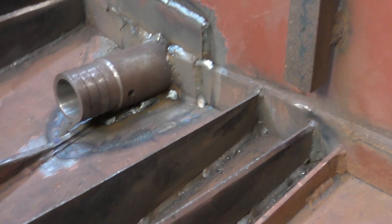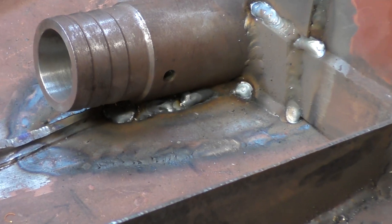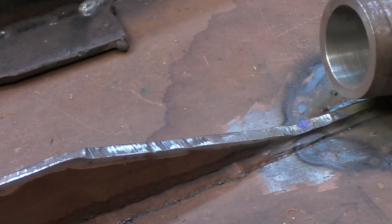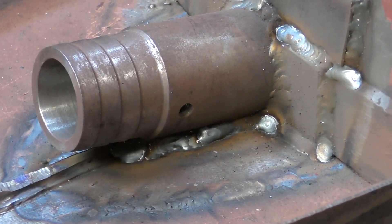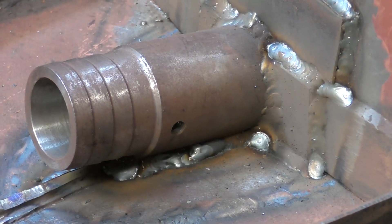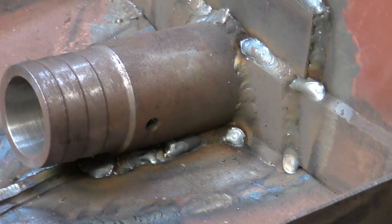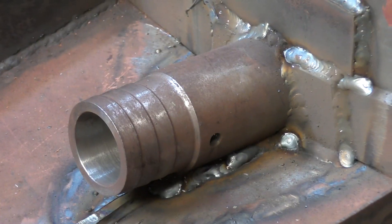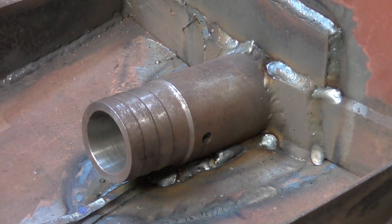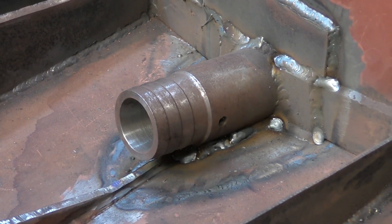Underneath, I did end up with a bit of a gap where I'd ground the profile bar leading down to that area. What I did was cut some wedges and slid them in as a nice tight fit, then welded the wedges top and bottom and around the forward end — and I did that on both sides of the tube. So not only is it welded nicely and heavily through the bulkhead, but it's also welded to the profile bar underneath.